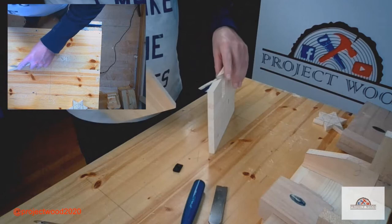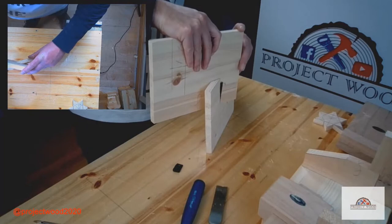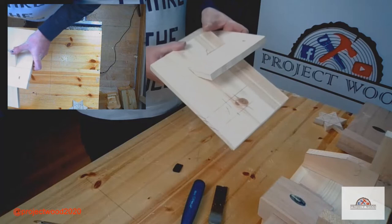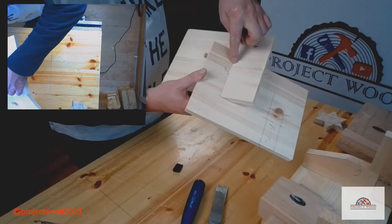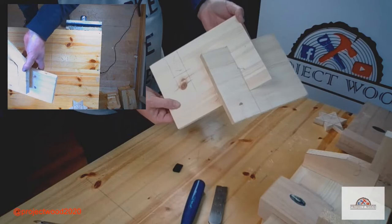It'll look very complicated to your eye, but marking out in that way I showed you, it'll slot together nicely, and we'll get that overlap hopefully. There we go. So we have that nice 30 degree overlap. If you do having joints all the way in, the two roofs will line up perfectly straight, but for this modern design, as we said in the marking out, we will keep them kind of offset like that.